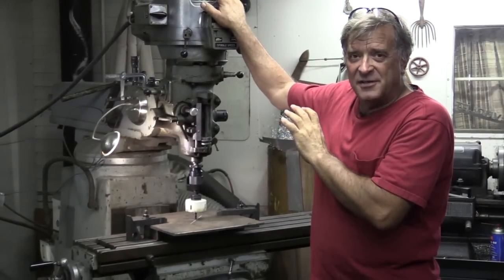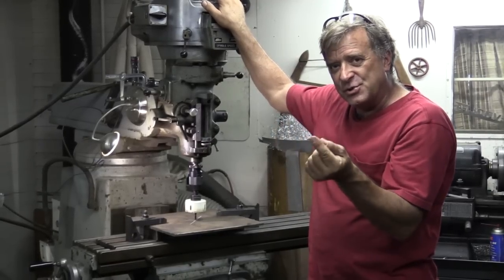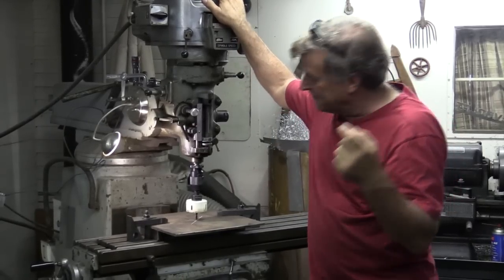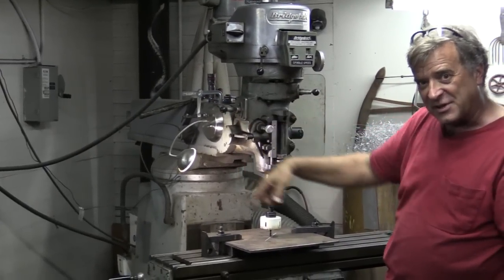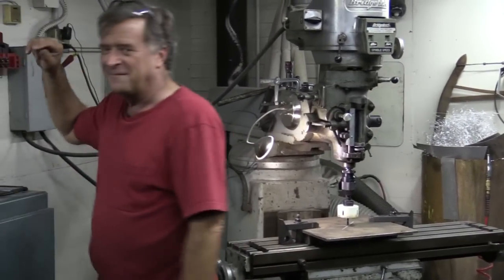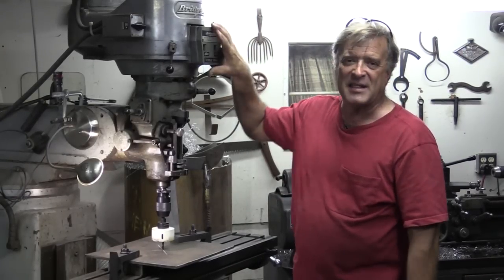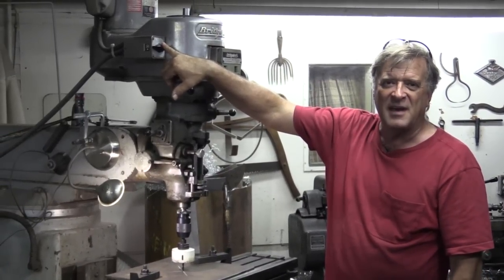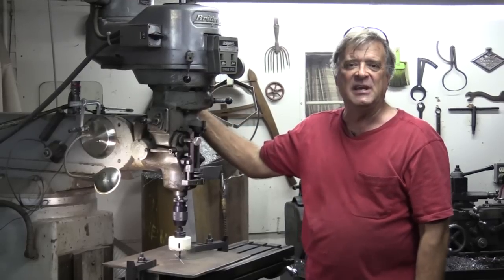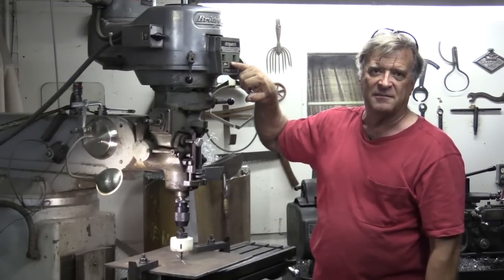One of the problems with a big mill like this is they're normally three-phase, but this one has a phase converter on the back that takes single-phase 220 and turns it into three-phase 220. When I flip the switch you hear something that sounds like a little jet motor starting up — that's the rotary phase converter, kind of like a little generator. As for machine setup: the on/off switch is up here, it's a forward or backward switch depending on which way you flip it. On the other side is the high/low range or neutral switch, which works with the speed control. I've just got it in low range.